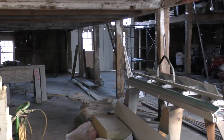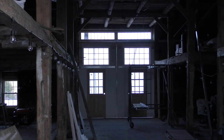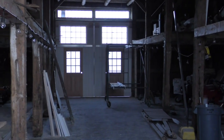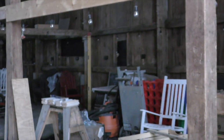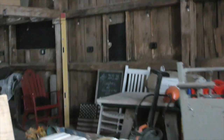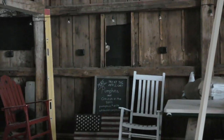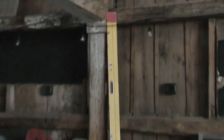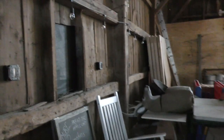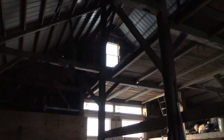There's a bunch of tools around and it's kind of a mess because we're trying to put these new doors in — and boy, they look good. New barn doors, exterior completely redone, and the interior is completely preserved. You can see these two black panels right over here — these are where holes were, either for flying in steel or for the bumper so we could get the decking down. It's black plywood with rock wool, two-by-sixes, and then T1-11 on the outside, with room in between for all these electrical outlets wired every two or three feet. Then this giant box for the garage door.